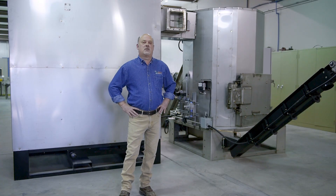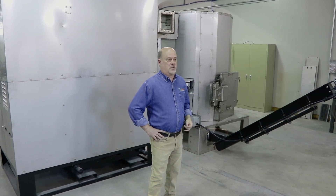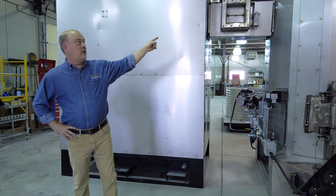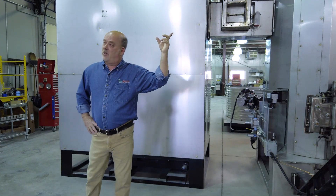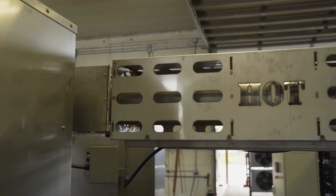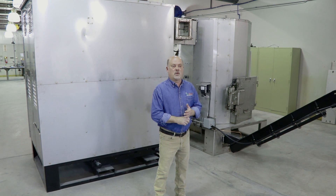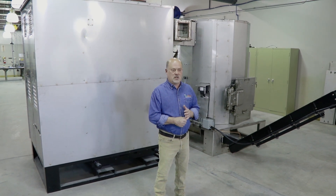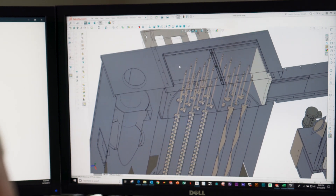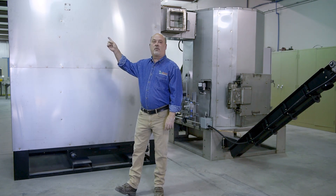Let's move from the combustion side of our technology to the heat exchange side. The big box behind me is the water heat exchanger. To get the heat from combustion over here we have what we call a bridge. You'll notice on this particular machine there's a little box up here — this machine is going to be attached to one of our biomass processing systems, and that's where we pull off the flue gas for our drying process. Inside there is a 350 gallon water heat exchange system with a lot of tubes in it. Very efficient in terms of capturing heat — coming off at up to 1700 degrees and coming out over here nominally around 300 degrees.